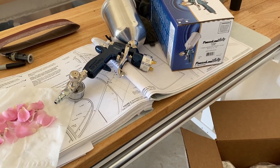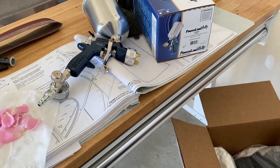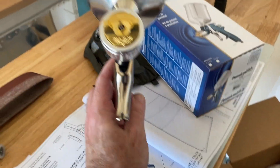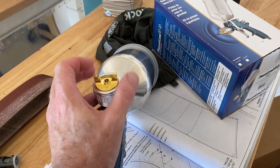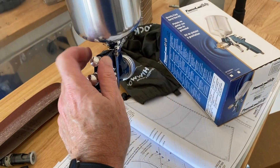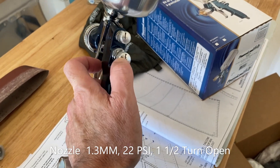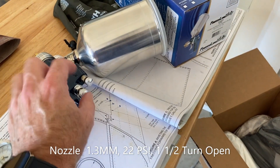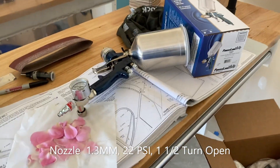The reason for that is because the air is always blowing, you don't get that sudden rush and you won't get that spot build-up — which for priming wasn't really anything I was concerned about, but now I'm looking for more of a nice finish. For the priming at 22 PSI, the way you work the head is you do one coat in one direction, then turn this head to the other direction and do another overlay coat. For priming you want to have the top button — which is the fan — all the way open because you want a good fan, and then set the flow. I think on mine I put it at one and a quarter to one and a half turns to get nice even paint.